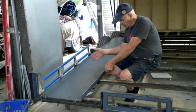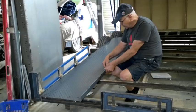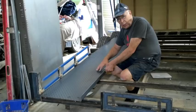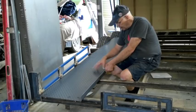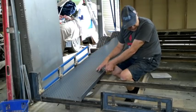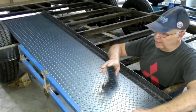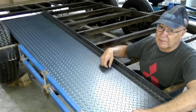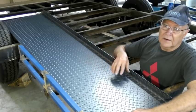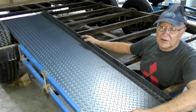How neat does that look? The strips have got a 50mm lip bent up on the inside done by the metal merchant, and they're 500mm wide. That width means I can put a wide variety of cars with different wheelbases and tracks on this trailer — with big tyres or little tyres. I reckon I could get anything from a golf cart to a four-wheel drive on this. If you had no access to welding, you could hold this down with sheet metal screws, but they wouldn't be very strong. Welding is clearly going to give greater strength — not just to the floor, but the floor is going to strengthen the whole chassis of the car trailer as well.